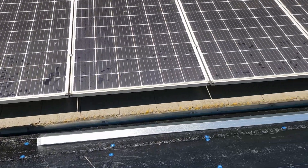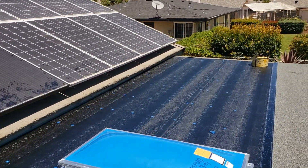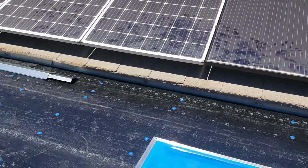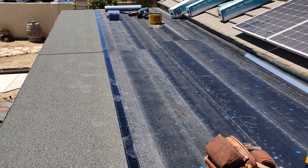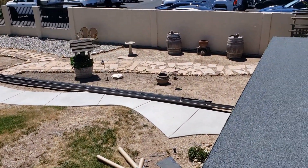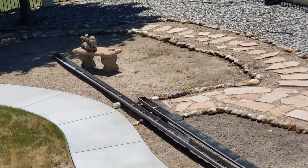Here's the flashing — you slide it in where the edge metal laps, slide the sheet metal straight in so you'll have flash counter-flash. There used to be a gutter there, but there's no room to put a gutter anymore — it would be pushed too far off the fascia board. There's a skylight up here too. They'll be done today with the roof. We took down some pretty long rain gutters and we're going to put brand new gutter on the outside of the new patio cover — a 50-foot-long gutter.